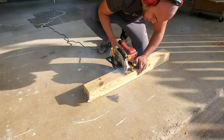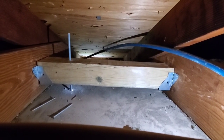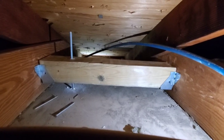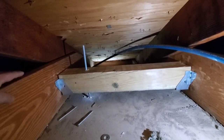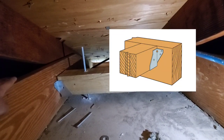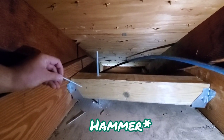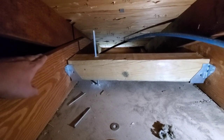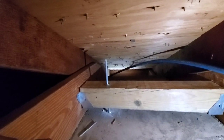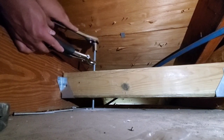Here's everything you need to know inside the rafters. Everyone's rafter will be different. Mine didn't have enough space to put a bar on top, so I got these clamps from Home Depot — two screws on each side to hold the beam in place. It has a specific hole on the side which I'll drill in with a nail. Once everything is secure, measure out to make sure everything connects through the rod all the way on top. Put spacers, a lock nut, hold it steady with the vise grip, then put the lock nut in place.